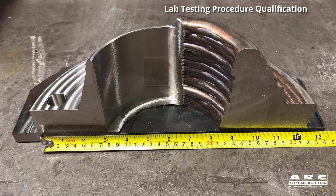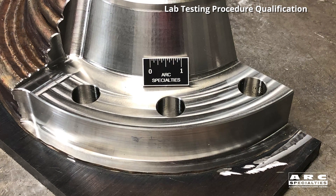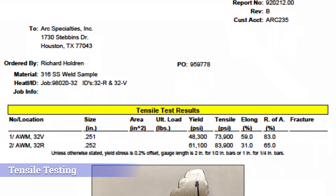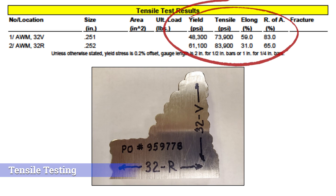After we finished welding, we cross-sectioned everything and then started to do our mechanical testing. We used dye penetrant and confirmed that these are sound welds — no defects at all. And then we pulled some tensiles also. The tensiles were all above the 72 KSI minimums set out by ASTM.